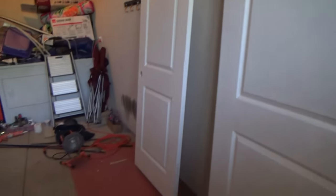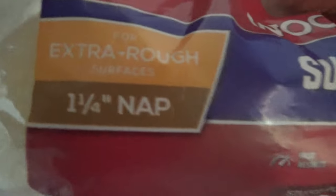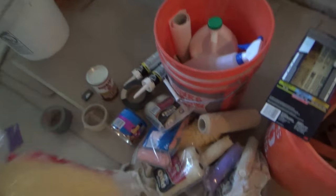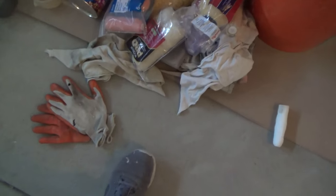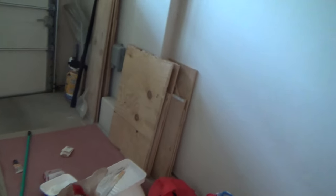They have rollers up to an inch and a quarter. I've got a nine-inch roller cover with inch-and-a-quarter nap that I use for walls. Believe it or not, I don't use anything like that for ceilings anymore. Usually for ceilings I go with my six-inch roller and I can do that all day long above my head, hardly spilling. It's easier to work the extension poles because the frame isn't as heavy. When you get a big roller full of paint up over your head on a high extension pole and try to go back and forth — try it and tell me how you like it. Then try the six-inch.